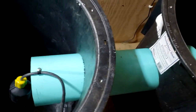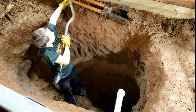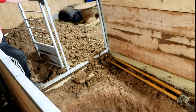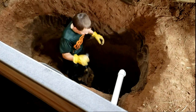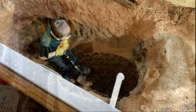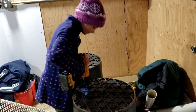We put a great big pipe between these two barrels — the holes were already there — and we put an alarm on it so when they fill up we'll know about it, which I don't think they will. We're digging a tremendous hole, getting down into the earth. You can see the French line coming in — that's going to bring the water in and drop it into the first of these 30-gallon drums. Each drum has got about 60 holes in the bottom.